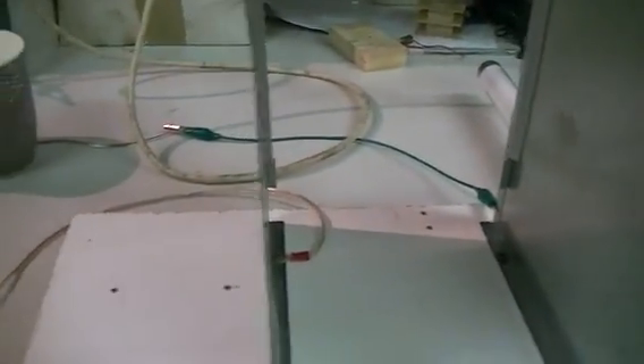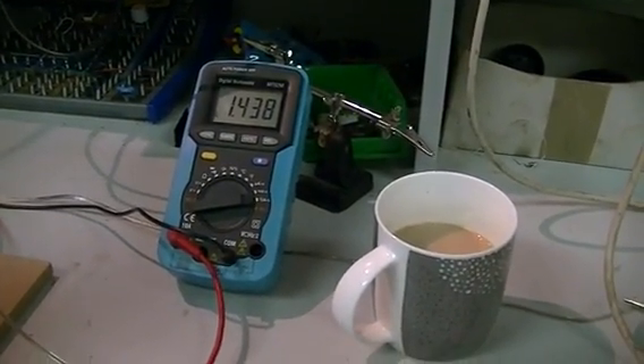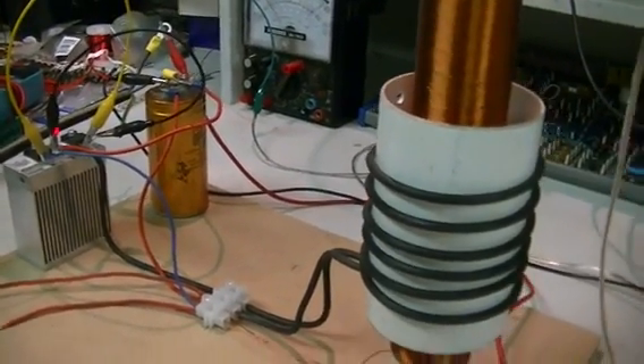But as far as the water goes there is no luck. Like I said, 24V at 1.43A, got that big 10,000µF 100V cap there to smooth things out. It works well as far as lighting up lights and neons and all that fancy stuff, but it's not doing the water trick. I can't get any bubbles anywhere or any gas, so maybe not enough power.